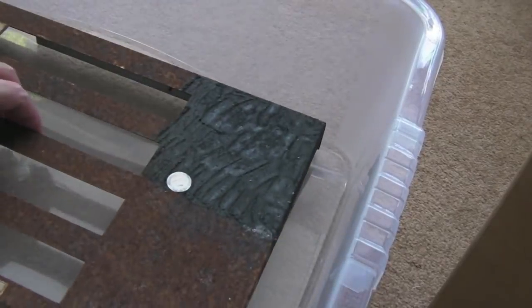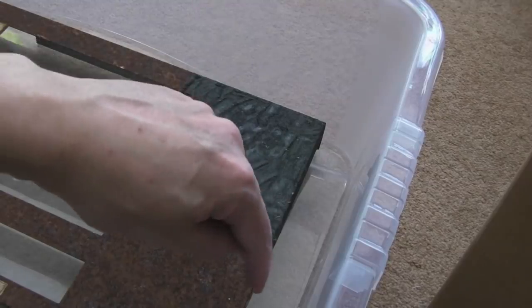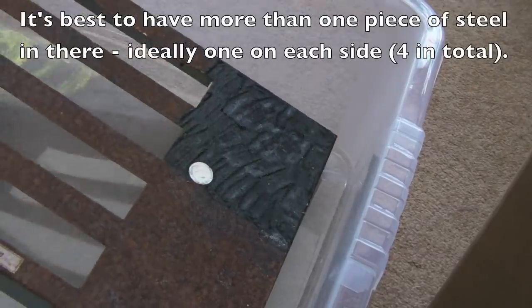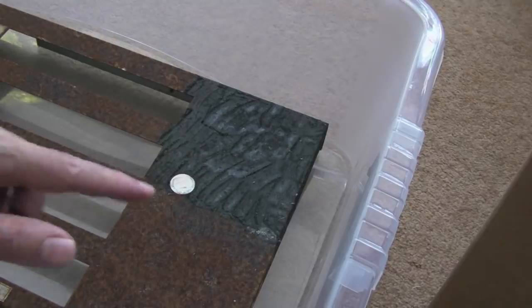So I've got a large plastic tub here, as you can see. It's absolutely huge. And it's just the right dimensions for the board here. So I'm going to submerge this in water. We'll add some sodium carbonate, which I understand acts as an electrolyte. So on one side here, we'll have a steel rod, which I've got. It was only a few pounds from eBay. And on the other side, we will connect to the chassis here. So electricity will flow through the circuit that way. And I think, in theory, it should remove the rust.